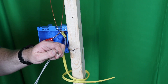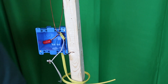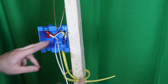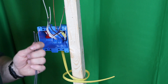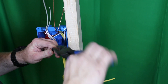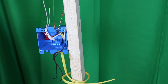Always make your grounds up first — I've said that in my electrical videos. Next will be your neutrals. Do the same thing — just twist these wires together. This is the correct pigtail. This is my favorite way, the way I'd do it anywhere I go. Put the wire nut on and go. If there was another neutral or another black in here, you'd add them in — but we have three wires because this is the end of the line.